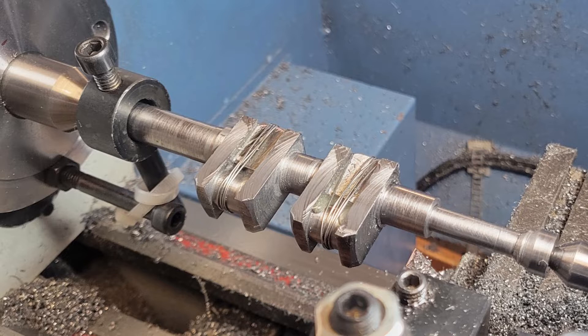I'm going to stop the lathe for a moment and point out a few things. First of all, we've switched to a smaller lathe dog, one that properly fits the shaft. We've ensured the securing screw is very tight on the lathe dog. It will be turned down further and threaded, so if we leave marring marks it won't be a problem. A recurring theme is being cognizant of putting any forces onto our crankshaft that would potentially twist it, bend it, or knock it out of perfect alignment. So when we tighten this screw on the lathe dog, we clamp the lathe dog in a vise and tighten it — we do not hold the crankshaft in a vise and tighten it down.